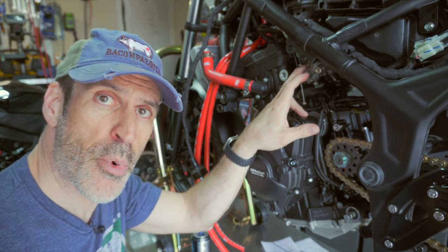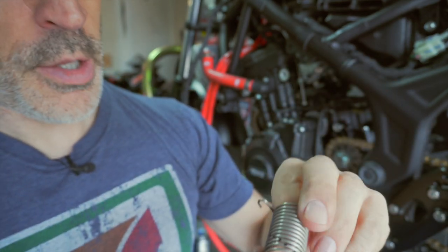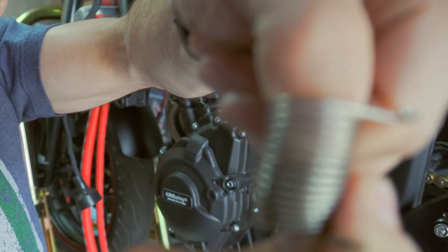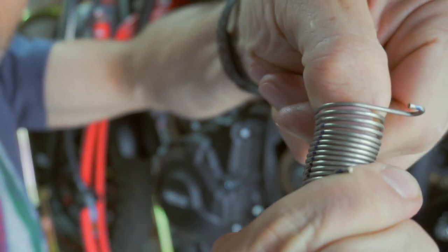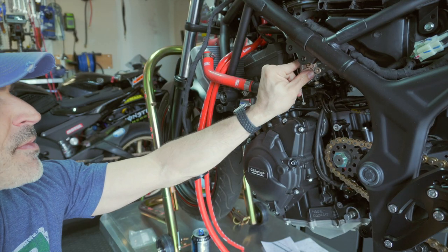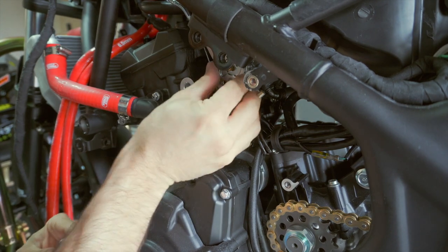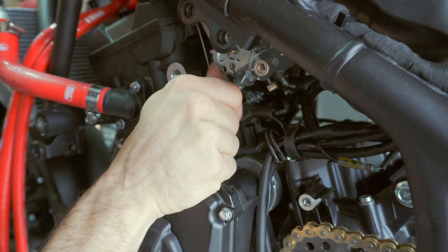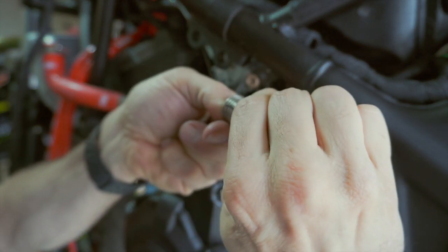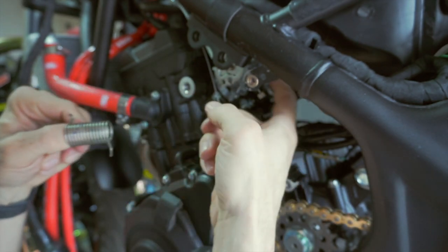There's one critical thing you need to know when you push this back into the right location. On the original spring you can see there are some little dots made with a marker. If I twist that spring you can see that line of dots lining up — that's how much you need to twist that spring when you reinstall it. If you just slide it in it won't have any pressure and the cam won't come back to the right location. After you install it, test it before you put that nut back on to make sure that when you turn it, it comes back to the right location every time. When you install it you definitely want to twist that spring so that it grabs the cam, and this little leg needs to be turned all the way to grab the other plate underneath.